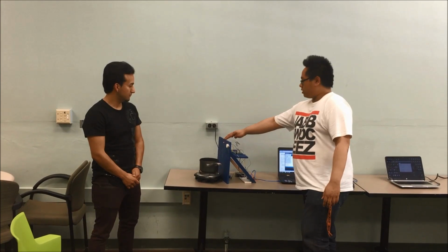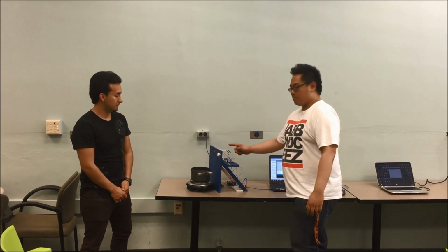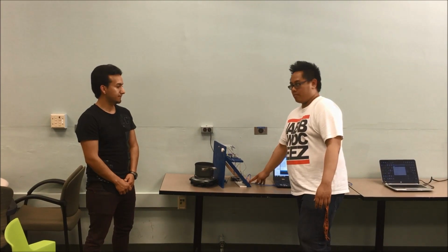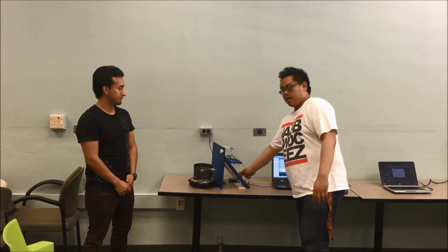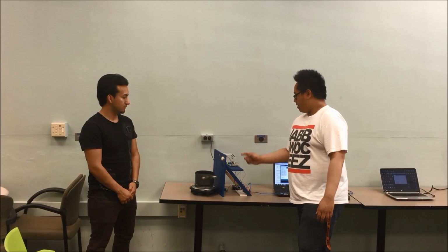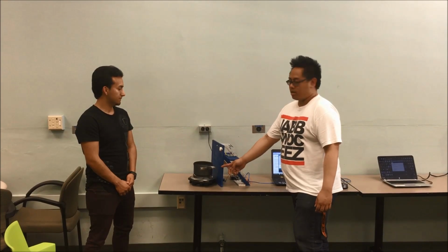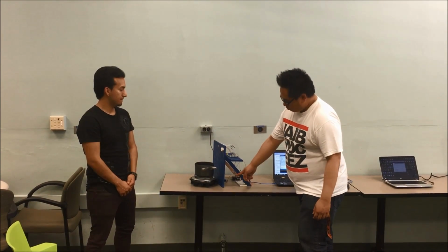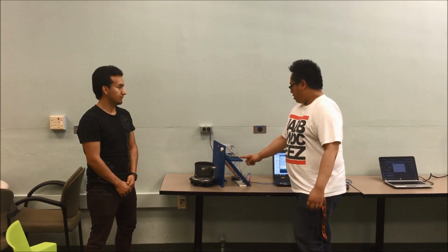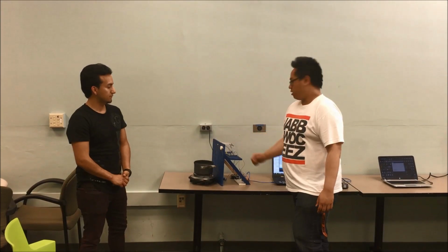From there, the sensor is connected to a prototype board that has all the resistors and capacitors allowing the temperature to be read and fed into our program, which is controlled by an Arduino Uno microcontroller and powered by a 12-volt battery. The purpose of our system is that if the sensor reads the temperature as too hot, which would be the temperature of the coil directly, then an electromechanical relay will be activated, which will cut off the power from the wall outlet and also turn on a buzzer, which will sound an alarm, alerting anybody that they left the stove on.